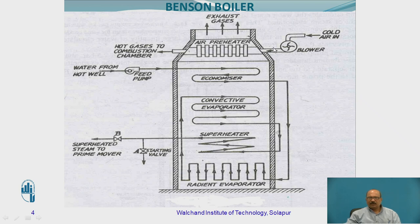Coming to the working: this is the blower being used. From the blower, natural cold air is going to be circulated. The blower is going to send the air to the air preheater. The air preheater is going to utilize the heat energy at the exhaust level of this Benson boiler — meaning the finer part of the heat energy is going to be utilized before it is sent to the atmosphere. This avoids unnecessary energy wastage and avoids continuously adding heat energy to the atmosphere, which may create additional problems. So we are going to be utilizing that heat energy — that is the economic part of it.